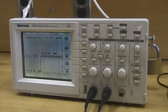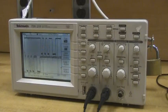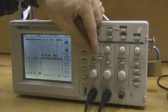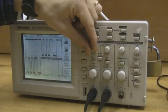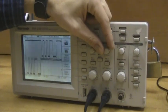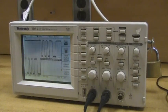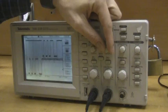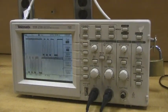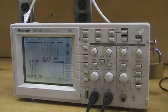Let's take a look at this character. What we'd like to do is measure bit times and word times. I'm going to press the cursor button, which will allow me to do some measurements. Using these two knobs, I can control the position of those cursors — you can see a small line here moving back and forth. I can move one line to the beginning of the transmitted character, and using the second knob, move this line to the end of that stop bit. Automatically I can see that took 39.2 microseconds. Or if I wanted to know how long each bit takes, here it looks like one bit is about 4.4 microseconds. That illustrates use of the cursor and also use of two channels simultaneously — one to look at the received character and a second channel to look at the transmitted character.